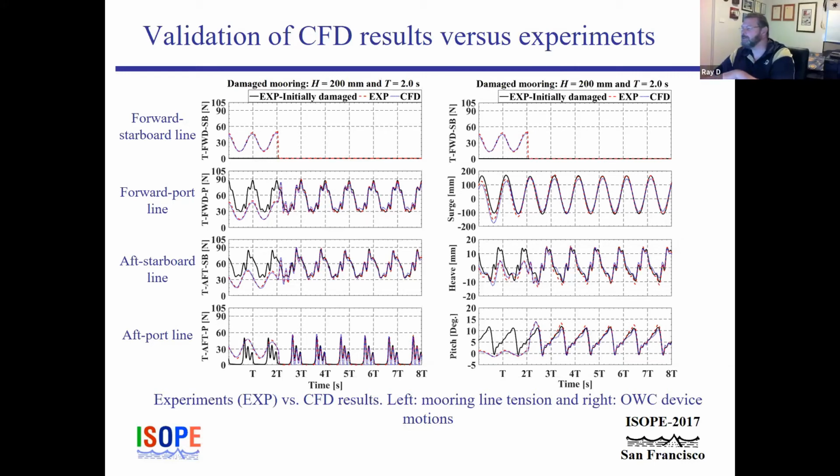No, thank you very much. That was sort of what I was concerned about, in that I could also imagine that if you had a tension leg and you had some big waves, you might actually get shock induced into the tension leg if the structure wasn't deep enough to maintain that tension at all times, no matter what the profile of the wave was. I've always seen mooring lines previously on offshore structures that are quite loose and have a catenary to them. And when I saw this, I said, this is different than what I expected.